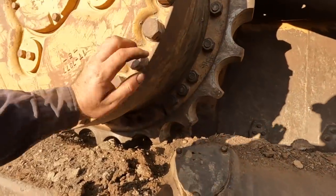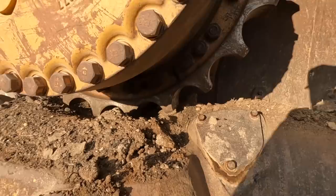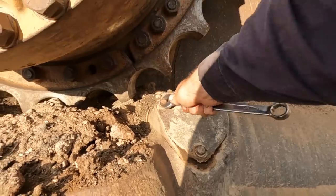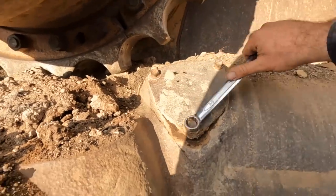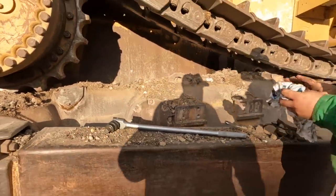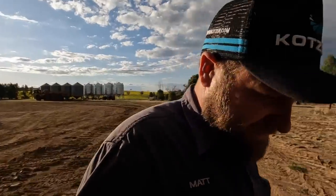Handheld, the hand pump. So just got to check this final drive, make sure its level's good. We'll probably have to bring the oil down tomorrow and do it, but I guess we'll know what we need to do if we check it now. Right, I'll jump in and back up, and just make sure that the blade clears the shuttle full of oil underneath. That would be a mess if I accidentally dropped the blade on all that oil.